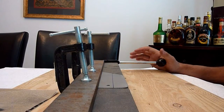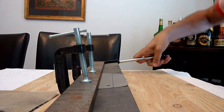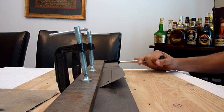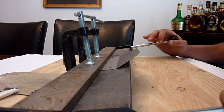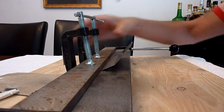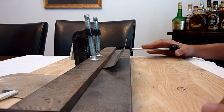It's important to remember that this is a DIY project and not a huge engineering feat, so we're going to put about a 15 degree angle on each bend, and you're going to do that just by eye. We'll do the center one first, bending to about 15 degrees. Then the next bend, again about 15 degrees. And your last bend, 10 to 15 degrees.